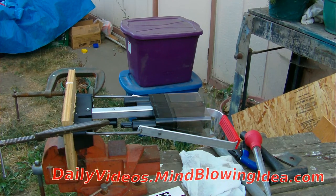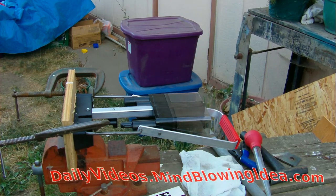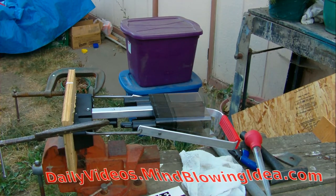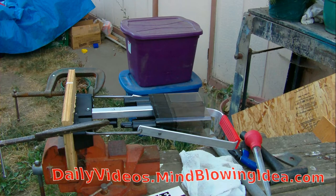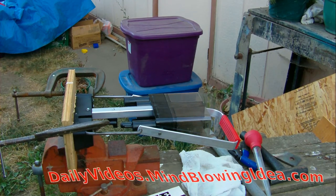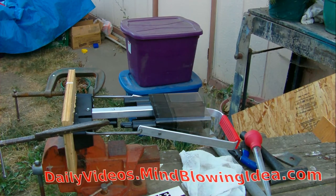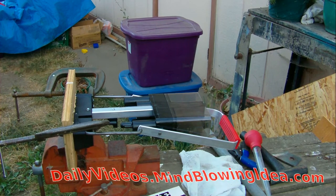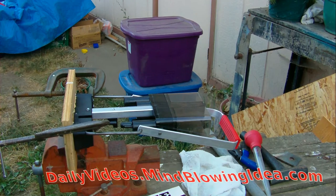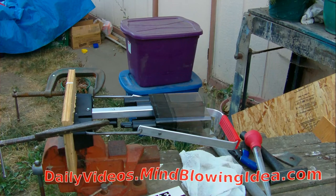With the mold, every one or two times you make a bullet, if you lubricate it with just a little bit of wax, it makes a big difference. Temperature is really important too. If you cool it down too much at the second stage — like when you put it on the damp cloth as instructed — then the bullets aren't going to pour into it as well unless you heat it up a lot. There's also a video where I modified the heating element so the safety wouldn't keep coming on every time the lead started melting — that's a do-not-try-at-home.